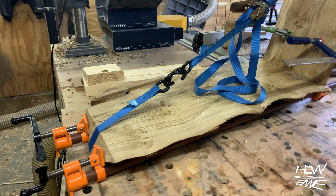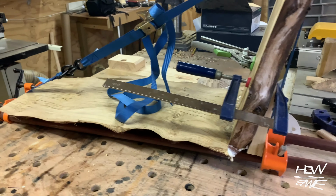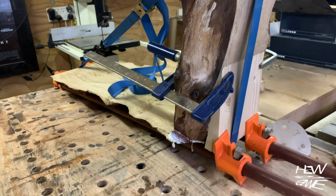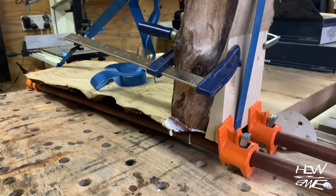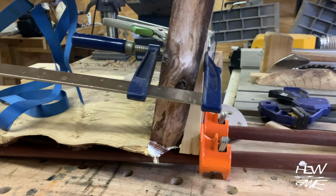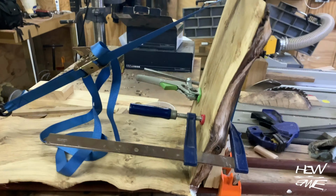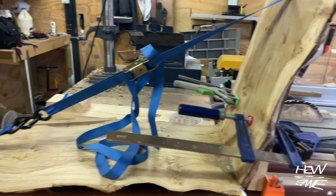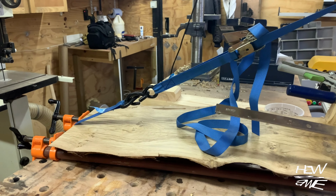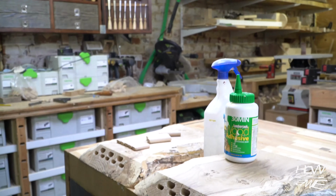Just thought I'd give you a show and tell of how I glued up that angled back to the seat. Those wedges I actually found on the floor from a clamping device I showed on Instagram a while ago. The clamps pretty much get it there. They're close enough to the angle I needed, and also that ratchet strap just balances it out to keep the miter closed on both sides. If you're going to use PU glue, gotta wear gloves.